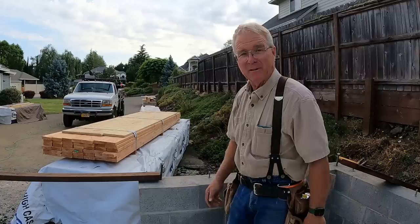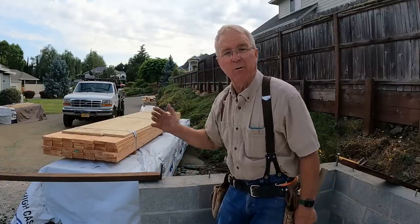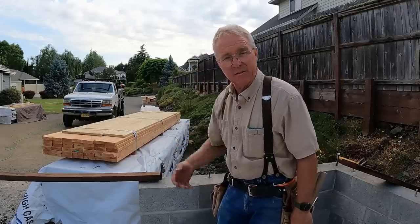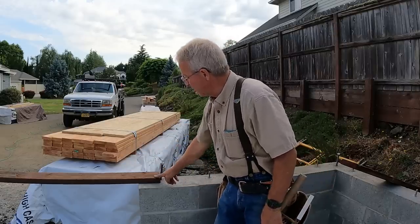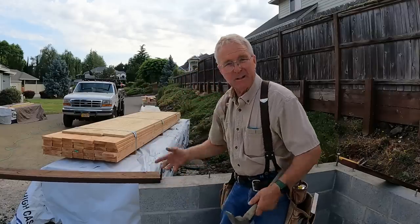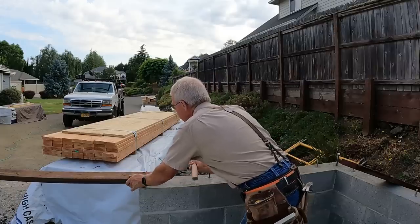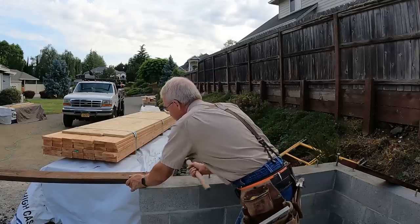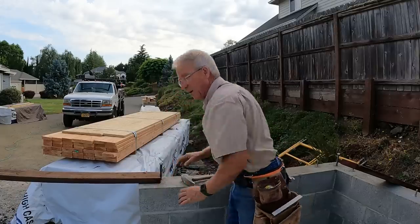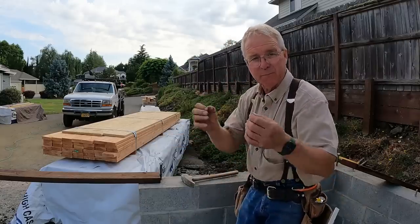And in this case, because I'm paranoid and because it's towards the end of this block, and I just don't want to break anything out of the end of this stem wall, I've got Ben pushing on this 2x6. Push on it, Ben. Backing it up right there. Kind of a bucking bar is what this is called. And I'm just going to bring that back to plumb. That's great. Don't want to have a catastrophe just because you're trying to fix a small problem.